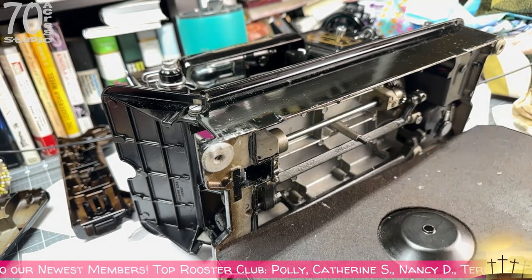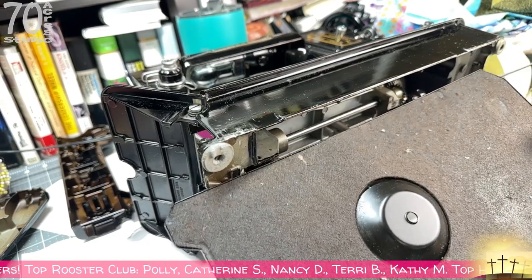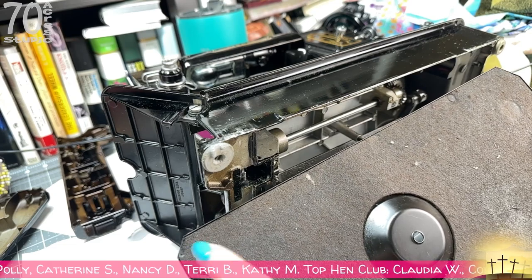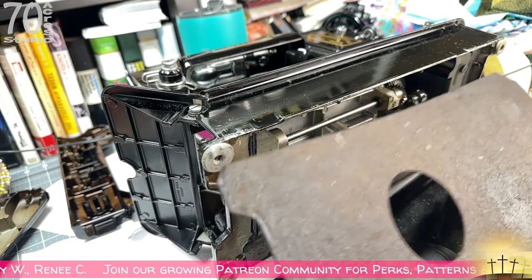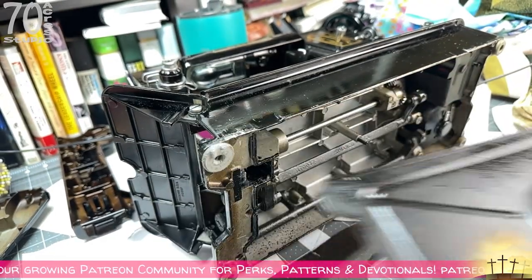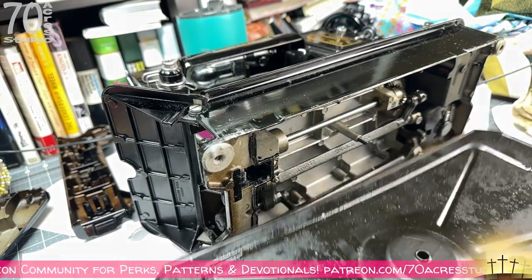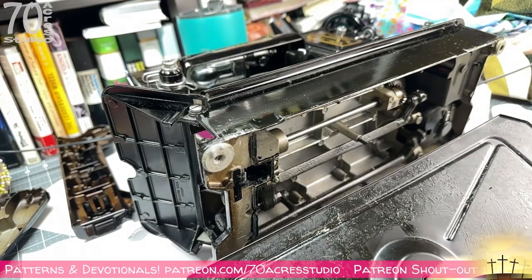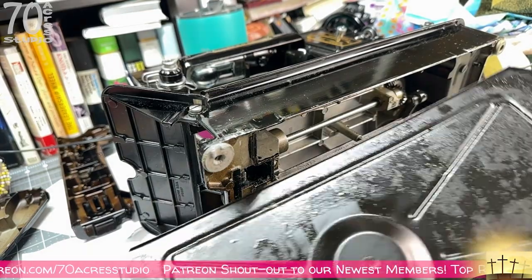Okay. And this here is your felt liner. And you can use the industrial felt and make a new one. If you have one in here, you can use it as a template to cut a new one. And again, you can take this off and inspect it and see how much oil is sitting here. Okay, you see all that? A lot of it feels very gummy and varnished. If you can see that sheen, that's varnish.